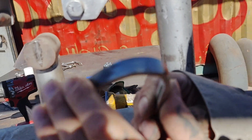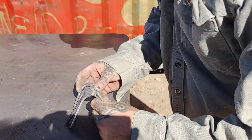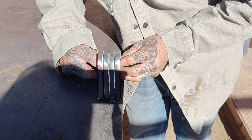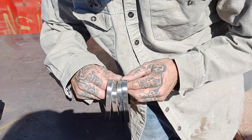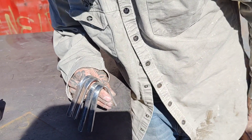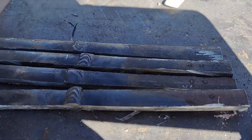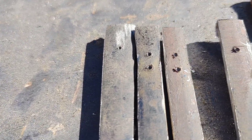Most of the time, after you're done taking your test like this, the inspector is gonna line them all up and add those little tiny specks up. And if those little specks add up to 1/16th or 1/8th of an inch, depending on the code, you might not get the job. They might want a flawless test — they might not even want to see a speck in there. It's really gonna be up to the welding inspector testing your test whether you pass. For me personally, that's a fail. Try it again tomorrow. It will be a face bend, and the two punches will be a root bend — that way you guys know I'm not cheating and trying to pull some wool over your eyes. This is the actual physical test strips. No Hollywood magic here.